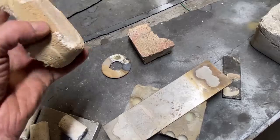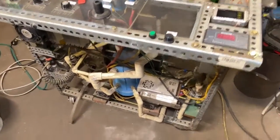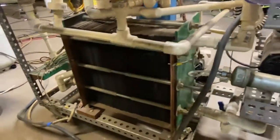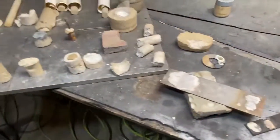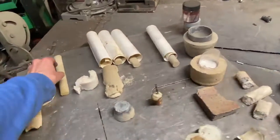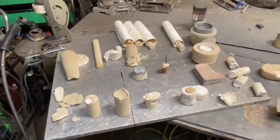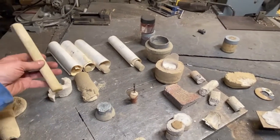It's way denser and heavier, and I don't know if it can handle heat any better but we're going to hit a piece of this with a torch also. We're going to be using 15 amps on a 240 volt system. There's a monster industrial size electrolyzer on this thing, so we're going to have plenty of oxyhydrogen gas to blast these materials with. These cores can be cured with carbon dioxide but if you reheat them after they've been set in the air they melt on you again.